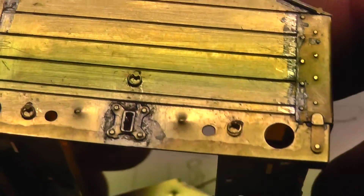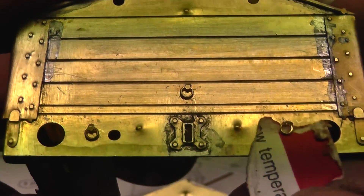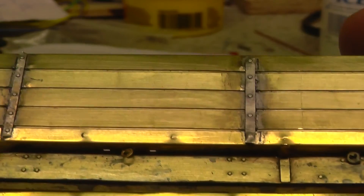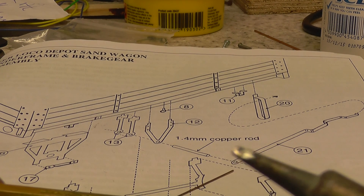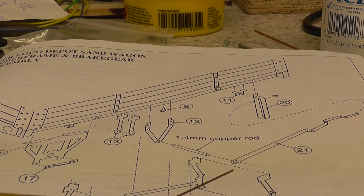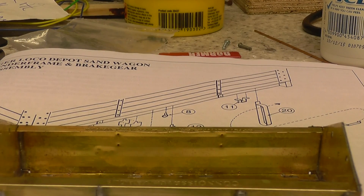These rings on the end are slightly proud. When I soldered them I tucked a little bit of cardboard just up behind to space them off the body a bit - so obviously holding that with hot solder and iron, my fingers are suffering a bit. What I did find is that I've been using a chisel soldering tip rather than a fine one, and that gets the heat out a little bit better - seems to be working quite well. The next thing to do is make a start on all the brake gear and chassis bits.